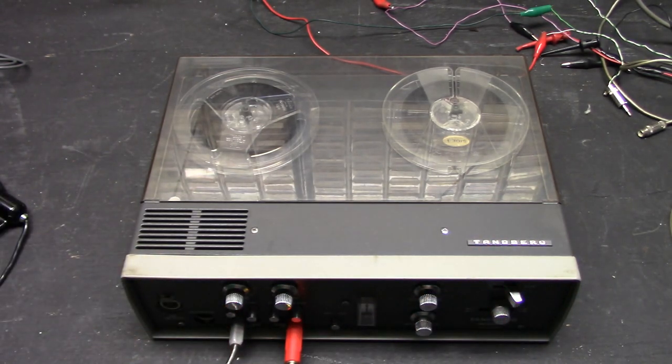Next, we will be showing how this unit records music with the music played directly from the recorder into the camera, and we'll be showing it at all three speeds. I hope you will enjoy that segment. Yeah, so the downside with this unit is the high frequency noise from the interference from the speed control circuit, but then again, I would not be too surprised if it were related to leaky capacitors.